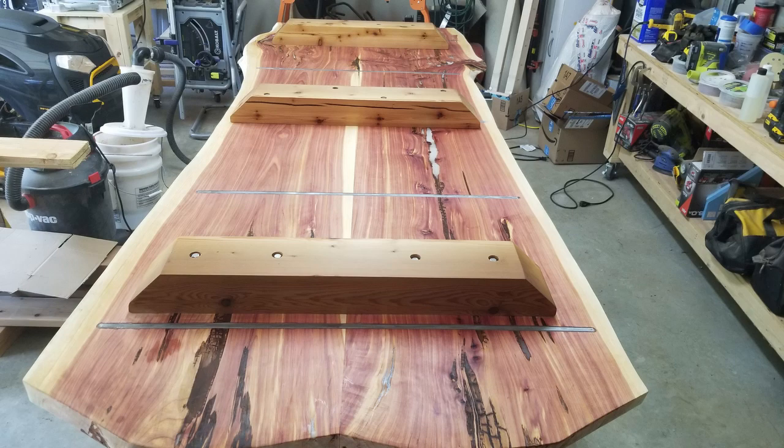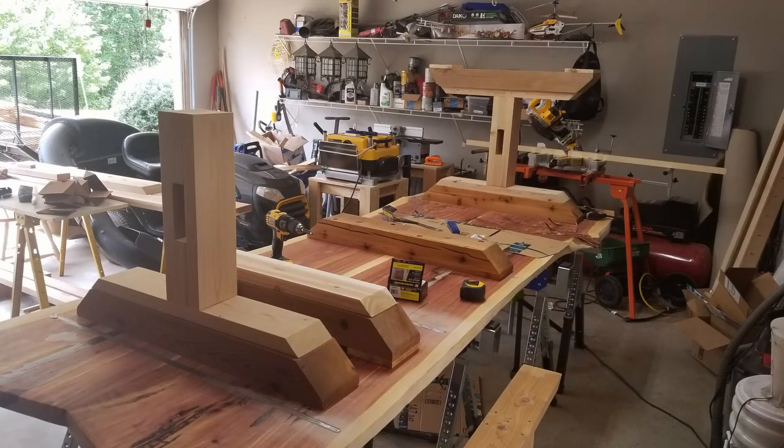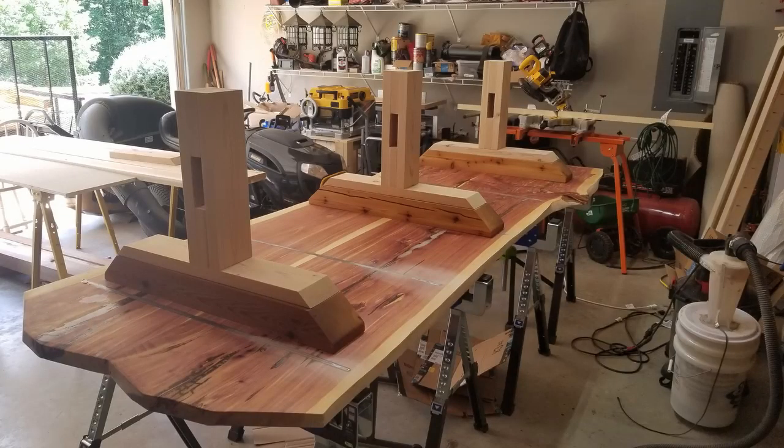The problem was the western red cedar that I bought was not dry enough, so I had to put a dehumidifier in the garage and keep the door closed — it was summertime, and I was dumping a lot of water out of that room. In about six weeks it dried down enough to use. If you look closely at that middle base 4x6, you can see a crack — it's superficial, but I went ahead and filled those cracks in with epoxy and sanded them down.